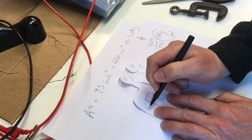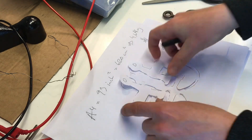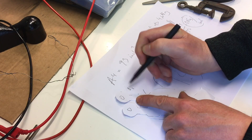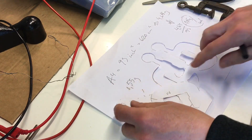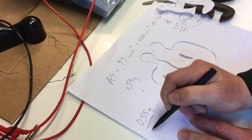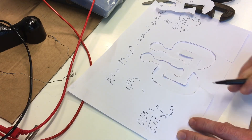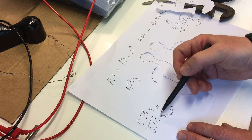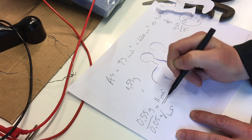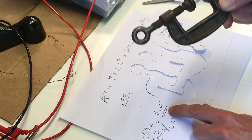Now we've got these two pieces — one and two — representing the two sides of this little tool that I'm going to electroplate. I've put them on the balance and these two pieces together weigh 0.55 grams. I take 0.55 grams and divide it by 0.05 grams per square inch, which means 55 divided by 5, giving 11 square inches. So the surface area of this is roughly 11 square inches.